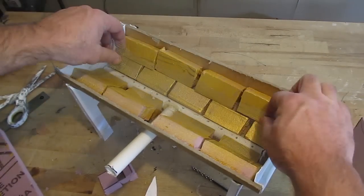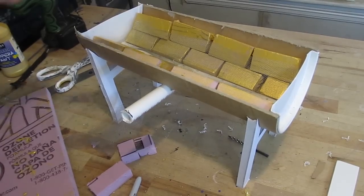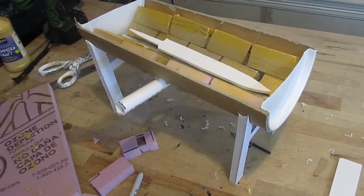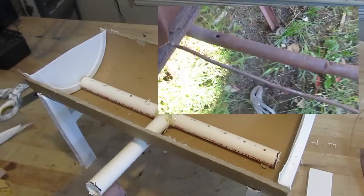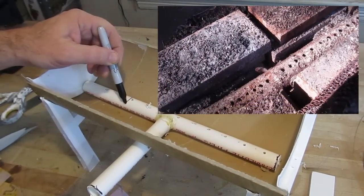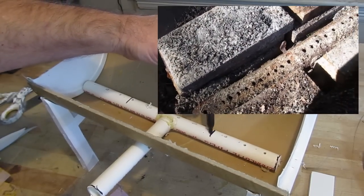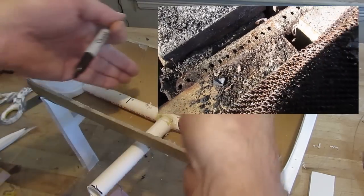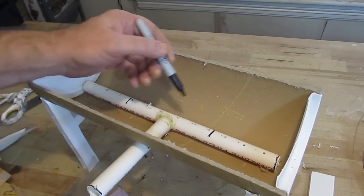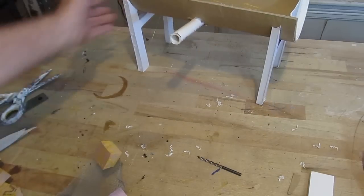Then you put a screen on it and that's it — you can start forging swords, just like my little miniature sword there. Now the paddles — you're definitely curious about the paddles. The paddles help control the airflow, and particularly you can centralize this, close them off and use the center section to get even hotter temperatures if you need to. I like the paddles; they help control the airflow to get an even heat.